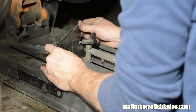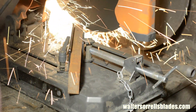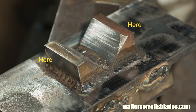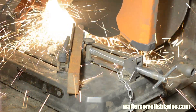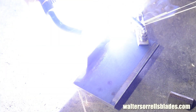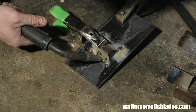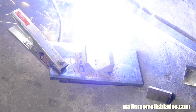I'm using my abrasive saw to cut four different cuts: two are 90-degree cuts and two are 45-degree cuts. In retrospect, I would have made the parallel support edges a little wider to provide a more stable base, but I sort of cheaped out trying to conserve stock. I've used them a few times and they work fine, but I'd be happier if I cut them about half an inch wider on each side. Now we'll bring the pieces to the die plates, making sure everything is measured so they're centered and square, then weld the first set together — and the retention flange. I'll run a bead down the center of the two and also around the perimeter of each piece going together to make the die.